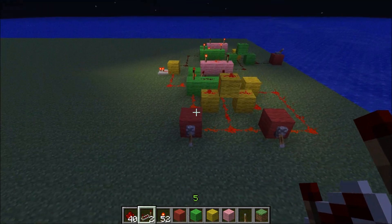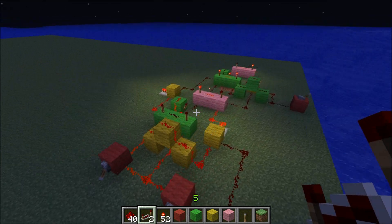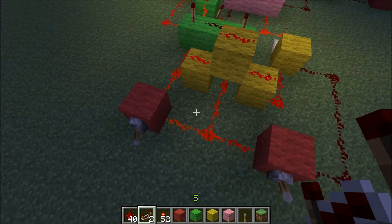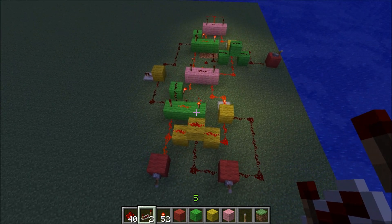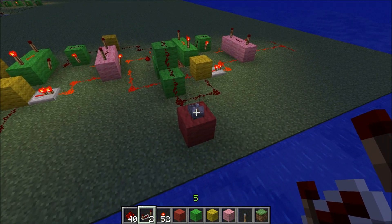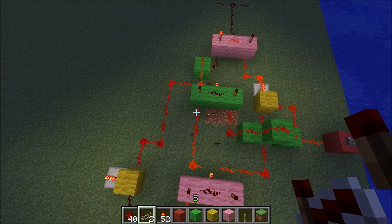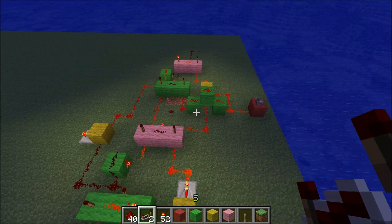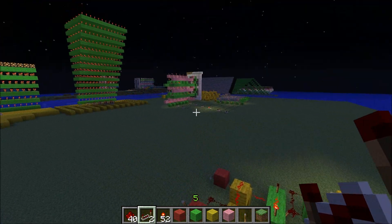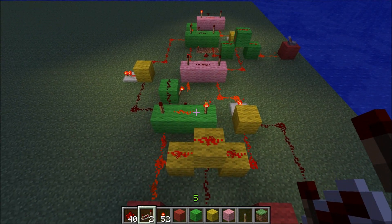So there we go — flick two switches and we have our carry out. Take one off — there's that. Add a second one again: that turns off, we get our carry out. No matter what, if we have two inputs, we'll have our carry out. That's what the second half adder is for. And all of this is pretty much what's in that line over there — it's just a matter of squashing gates in to fit your needs.